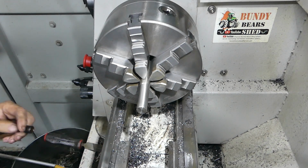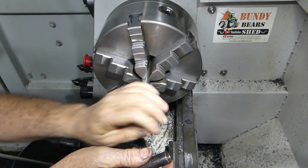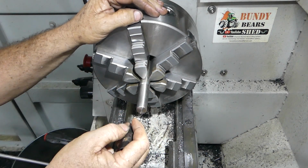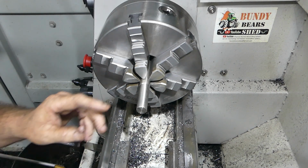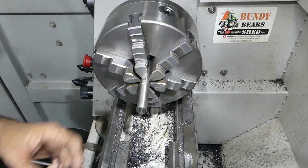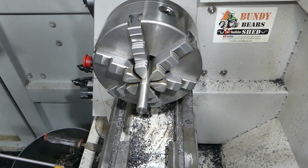Now, I am still about half a thou too big here, but the temperature's pretty good there now. Look, I can hang on to that. I'm not worried about it going hard, but what I don't know is that when I drill the guts out here, whether that will change this at all. So being about, oh look, it's half a thou, three quarters of a thou on the big side at the moment, and by taking the guts out here and making it into a piece of tube, well, I don't know what effect that's going to have on it. So anyway, we'll know shortly.